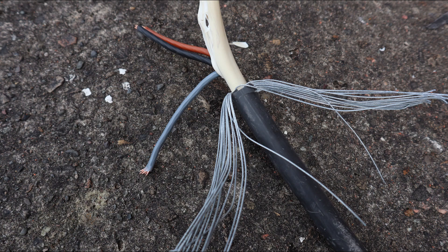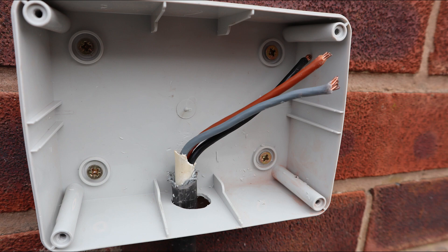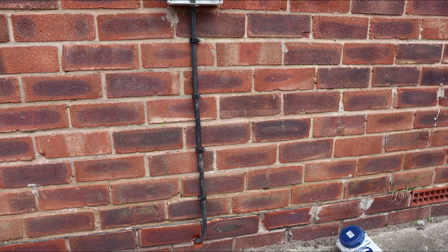You can see all the strands of steel cable - you could probably run a car into it and it'd be fine. That's it coming through the outside wall; just need to run some cement around there when the job's finished. Up into the meter box I'm putting ferrules on. The hole at the bottom is quite big to clear the cable and strands, but that'll be sealed with silicon. That's as far as I've got so far - ferrules to fit, cement the bottom, then the electrician is coming in six days.